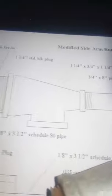The tip should extend down to pretty much the start of where the venturi is — somewhere about there — which is adjustable via a set screw. You move the pipe and tighten the set screw back up. I'll put the dimensions down in the description so you can see the bits and pieces to use if you wanted to make one yourself.